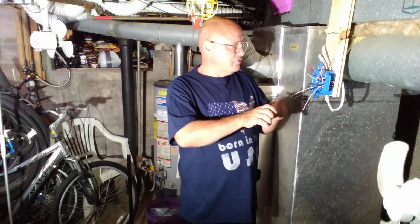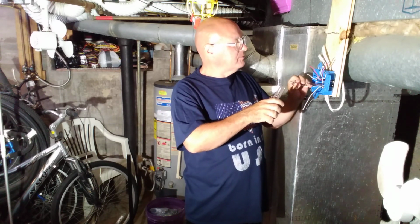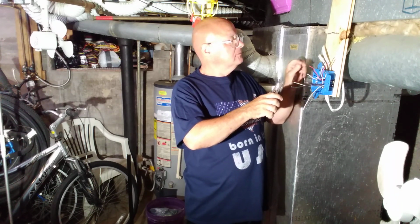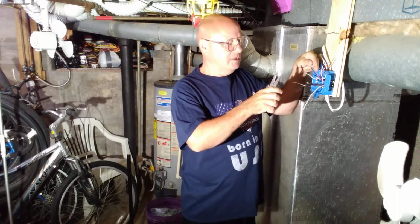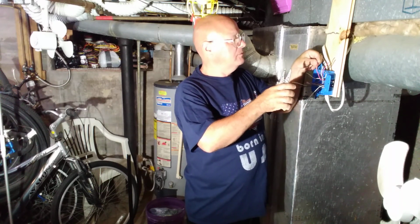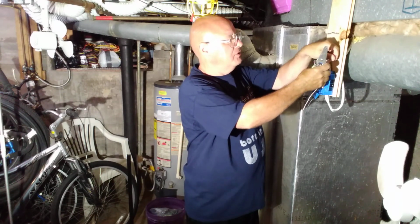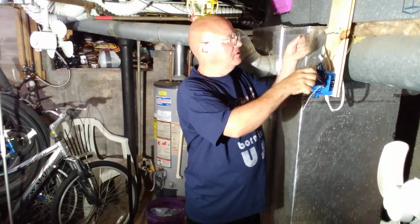Okay, so now we'll strip our wires here. This is the power coming in. This black and white is the power coming in. And these are the red and the white we're going to use as the travelers. So we will connect them together.